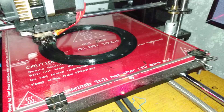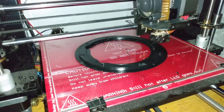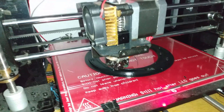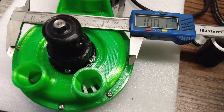The other issue I'm having with dead-headed pressure is likely caused by this ring here in the middle of the two housings. Normally I would have made this out of TPU, which would have helped it seal, but the printer I use for TPU was down for basically the last month. So I just printed it out of PETG like the rest of the housing. Before making any more attempts at building pressure I'd have to fix that part.